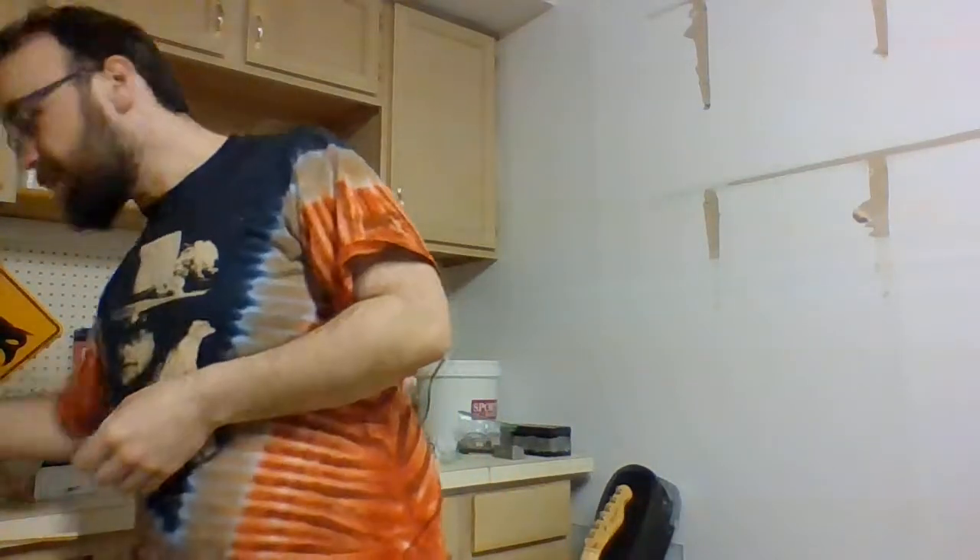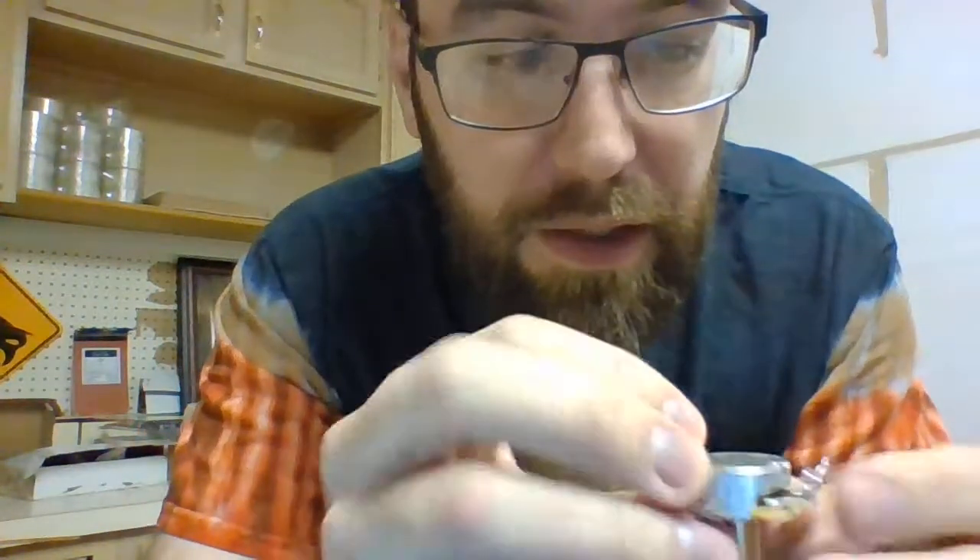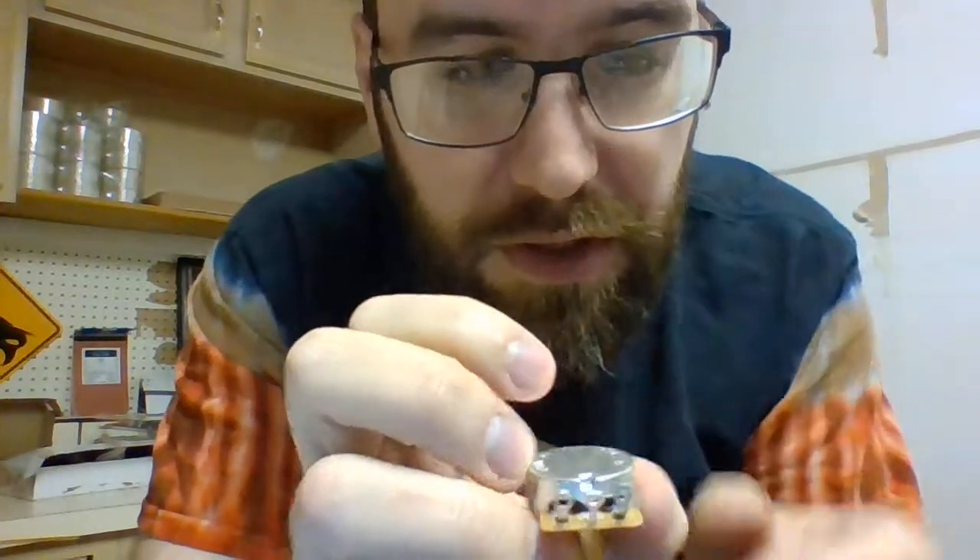That's what I'll do when I wire them up. This is what your pot looks like - your volume and tone. There are a few things you do with this. They have different ratings. Some are better than others, some sound fuller. Stratocasters use one of the lighter ones, humbuckers use a bigger one - I'm going big, I always do. These pieces are where wires are going to attach to, and one's going to get bent back and grounded. Grounding is very important because if you don't do it, you're going to electrify yourself when you're playing the guitar. Grounding is super-duper important. They didn't always do it, which is scary.